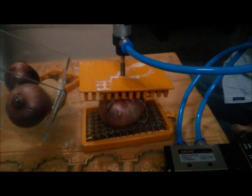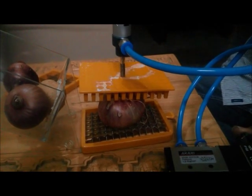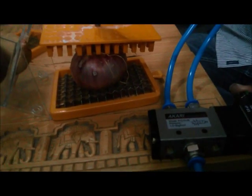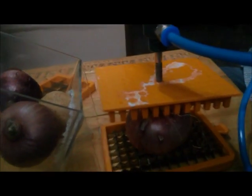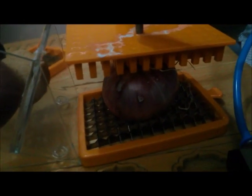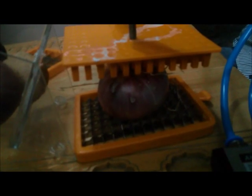For the vegetable cutting mechanism, since our system is a 100% automation system, we will be implementing this part in the coming phase. We have used a pneumatic piston controlled by a solenoid valve which pumps air. It is a 1-to-2 configuration in which a single pipe receives compressed air input, and with the help of a solenoid switch, the compressed air is channeled into the piston, actuating either compression or expansion. The vegetables are stored in a stack, they drop down onto the blades, and when the piston compresses, they get cut and sliced directly into the pan.